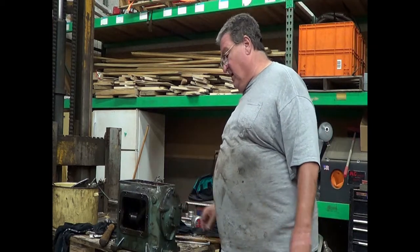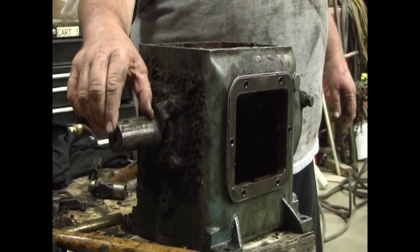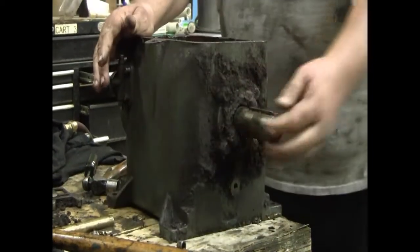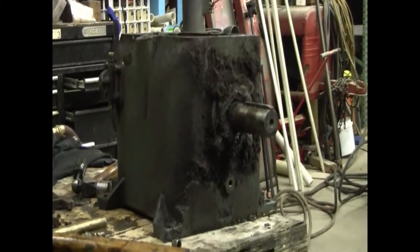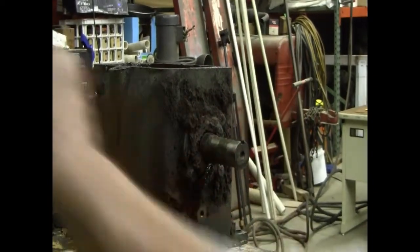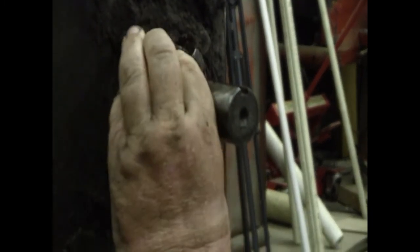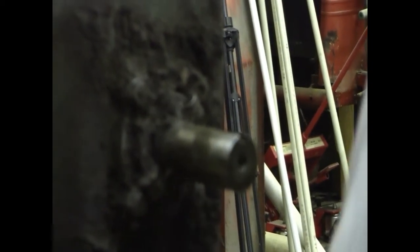We're just about done with the teardown. We've got to take this keyway off — the key helps keep the flywheel from slipping, so I've got to knock that keyway out. The reason we took the key out of the keyway is because we're going to take this seal off next — the seal and seal container would not have come past the key.